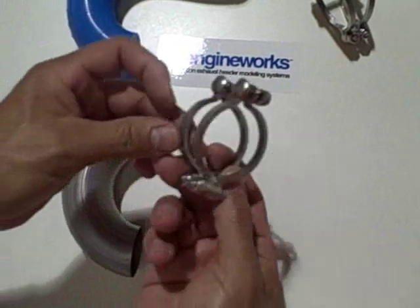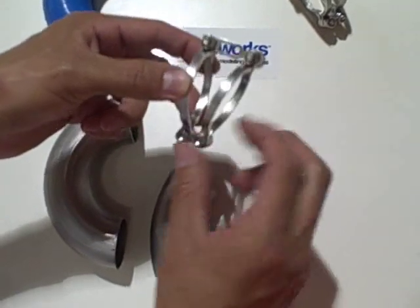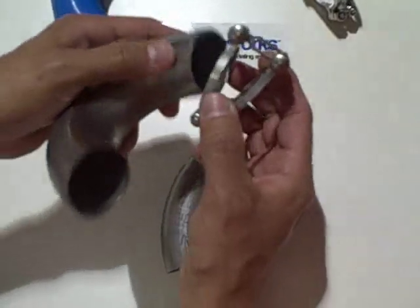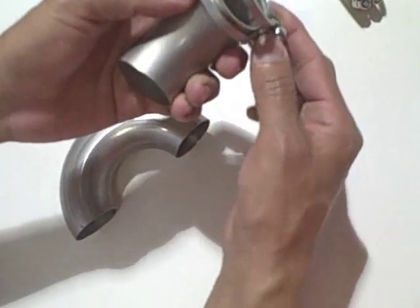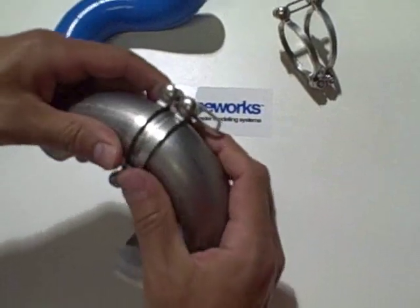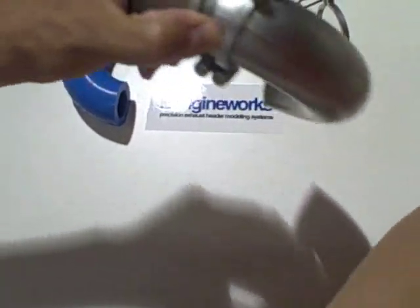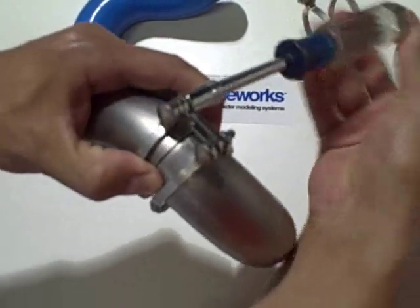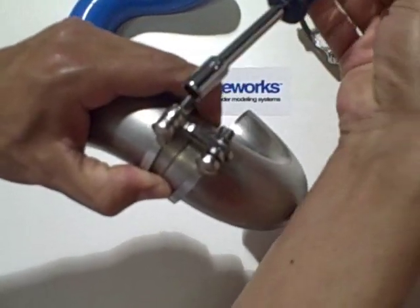The basic design principle of the tack welding clamps is that they have two independent rings, one for each tube, all connected through links that are adjustable. This gives the clamps and the metal section a wide range of possibilities — we can spin it around and arc it in many ways to accommodate any new section that needs to be added. Once in place, with a single hand I can easily create a joint that is very concentric and eliminates any gap in between, so placing a tack weld is very easy.